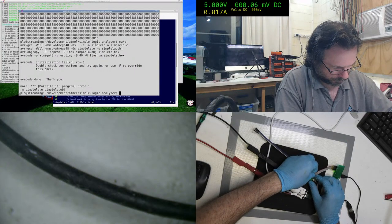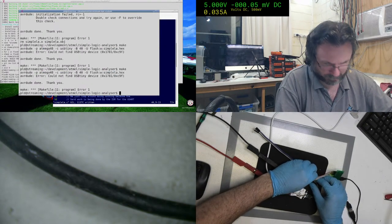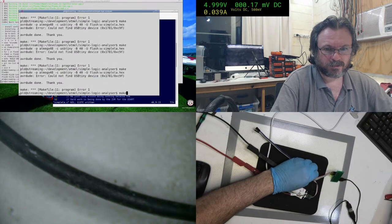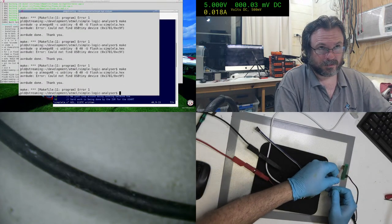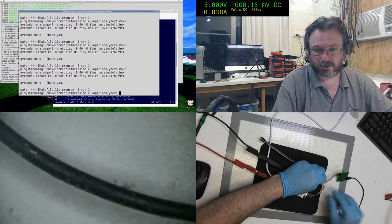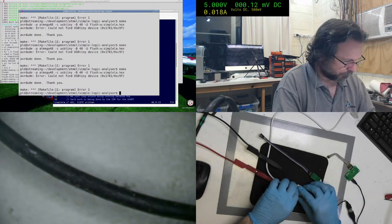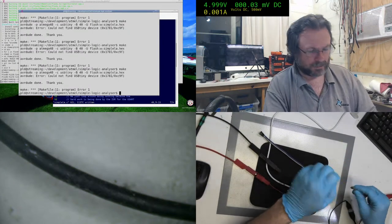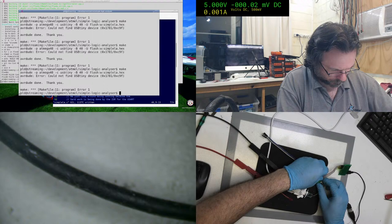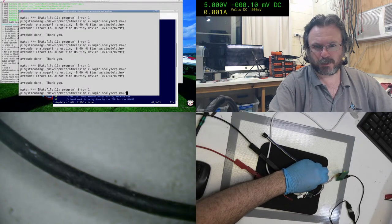I think I'll just plug along. Yeah, Tom, pin the byte, pin A, B, C, D, etc. refer to the entire port. Okay, I think I just fried something. Yeah, so within the 8-bit byte of pin B or pin C, it contains the state of all the individual actual pins. So you have PC0, PC1, PC2 contained within pin C.